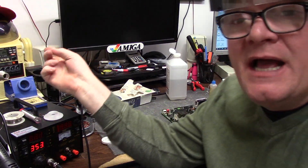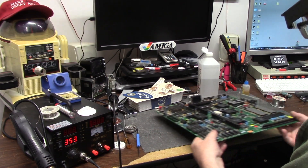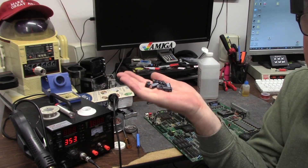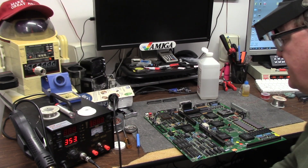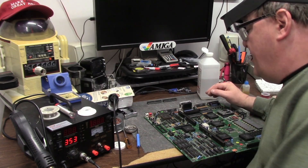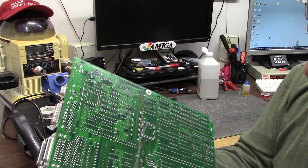Day two on Mr. Allen's board — it's 9:53 AM. This isn't a consecutive day; this is about a week later. Whoever recapped this board used these big Empire State Building 50 470s instead of 16 470s, which is normally fine — I would do 25 470 myself. But whoever put these caps in just smashed every trace possible. This thing's starting to look like a damn dinosaur on the bottom — I mean, I've got bodge wires and patches and solder drags and metal clips and points that just don't exist, and wires everywhere.